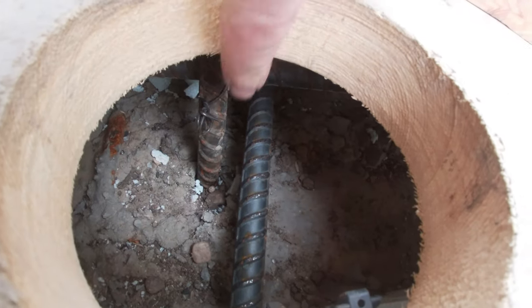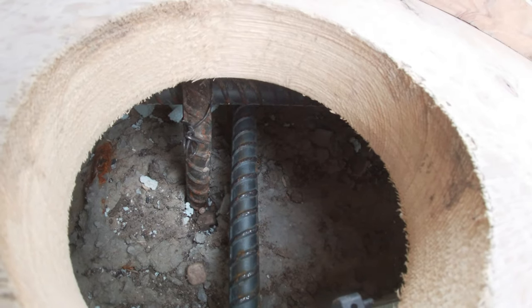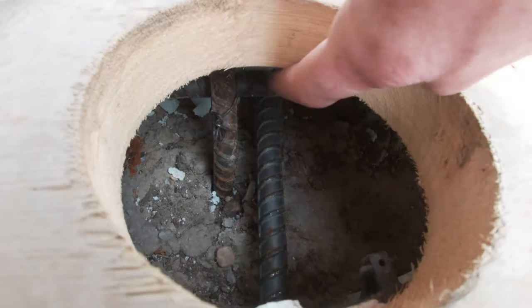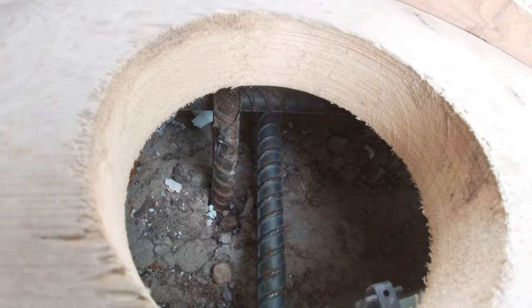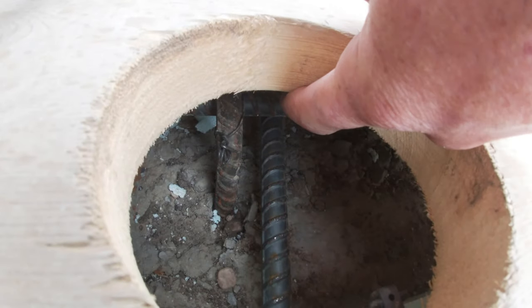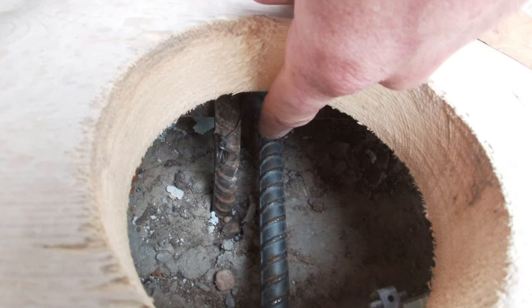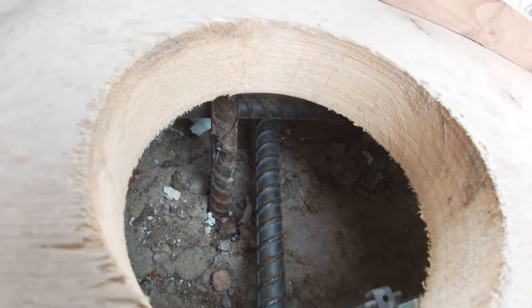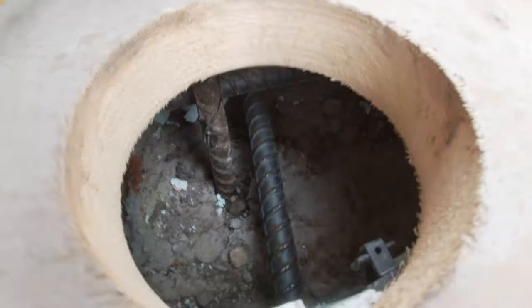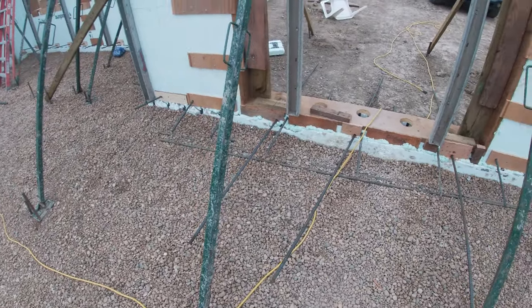inside there's this stirrup here, and we installed those in the frost wall. You saw those earlier probably. And there's this bar on top of the stirrup that ties to it, and these bars go under that bar, which goes under that bar. So for this thing to ever pull up, it would basically have to pull the whole frost wall up. It can't move. And that's what ties the pad outside and the floor inside. So that's a really awesome design that he put together there.